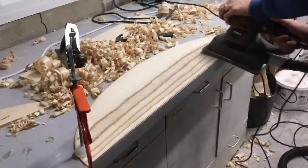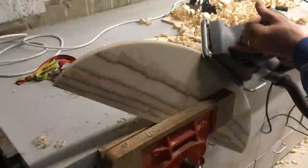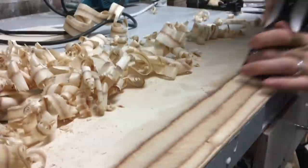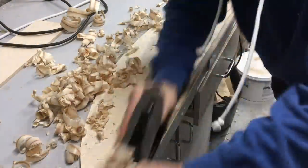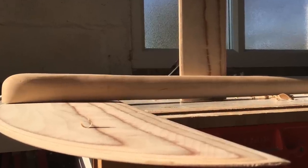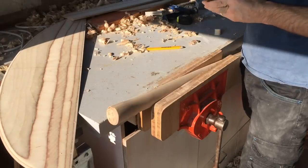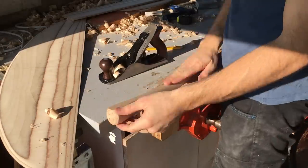I chose to use 9mm birch ply, however it would have been a lot better if I used something without grain that had been crossed over at 90 degrees, such as in the birch ply. It has two different directions of grain. Unfortunately, the strength I need is in the horizontal direction, and with birch ply, the way it's made, the layers are built up at 90 degrees to each other, so only half of the laminate is actually in the direction I need it to be, so the wings are quite flexible. I was able to get around this by putting three layers of epoxy resin and fiberglass on top, but it probably would have made a stiffer wing if I just used a single piece of pine.